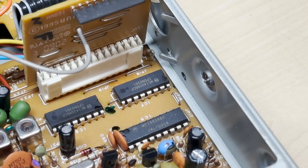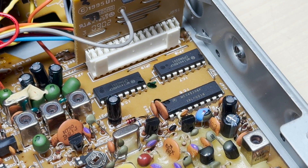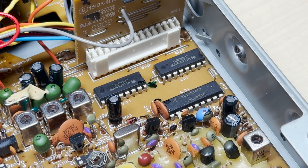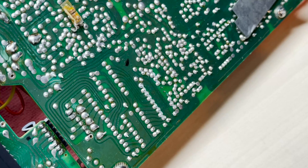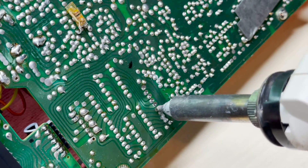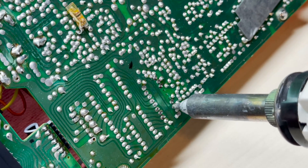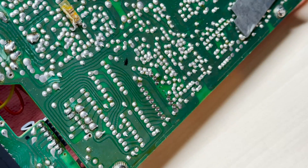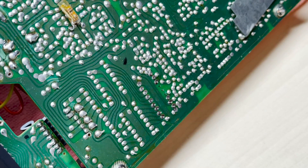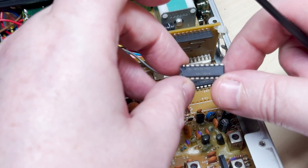So we took all the lids off — there's our PLL chip and we need to get it out. With the aid of a desoldering gun, I just popped a little bit of flux onto the solder just to help it come off nice and easy, desolder the PLL chip, and gently work it out of the board. And there's our PLL.